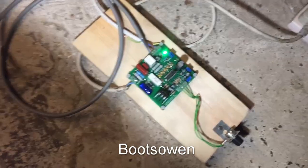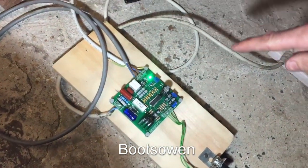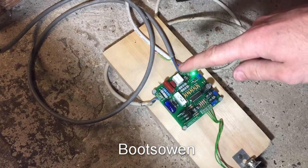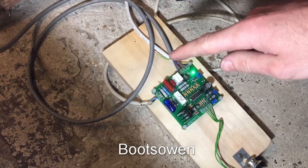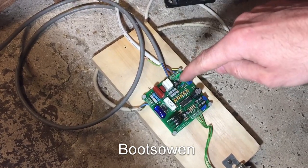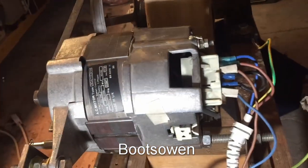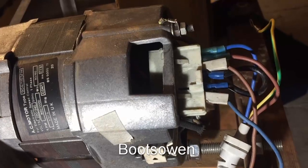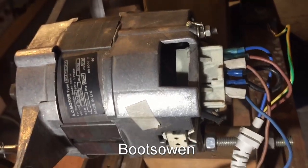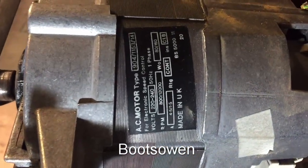Okay, so back on the board over here. I've got it wired into the mains — this is all live, that's just plugged in. Green light's on. The brown cable is the one going to the rotor-stator arrangement, to the motor bit. And the white cable is going to the tacho. So then up on the motor up here, they're arranged as appropriate. And that little black cable is making a loop between the brushes and the coil — one of each.